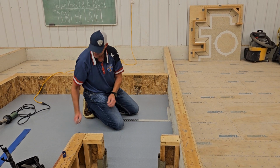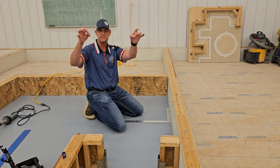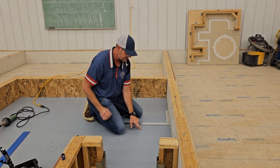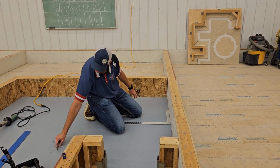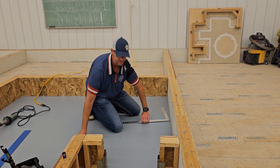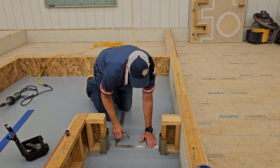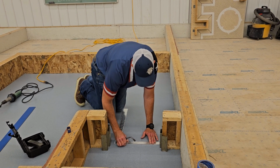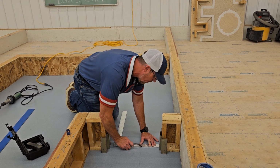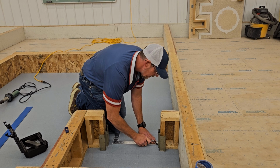Okay. You should have 2 pieces. If you groove it properly and you're centered when you groove, you should have 2 nice pieces. And you're hitting both edges. Here's another one I can groove. I'll align it, make sure I'm centered over the seam with the groover, and go ahead and groove.